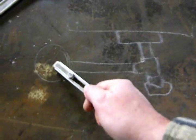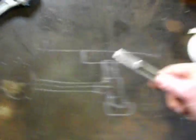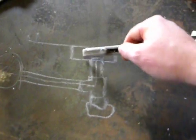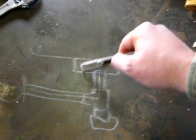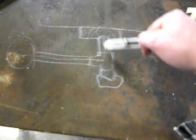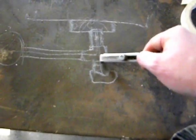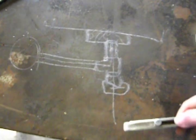The idea is air is forced in here, up through the bottom, through a fire grate. Some of them may or may not have a clinker breaker, but your coal sits in here and the air comes in and injects a little bit of oxygen, making that fire really hot. Ashes that fall through the grate end up down here.